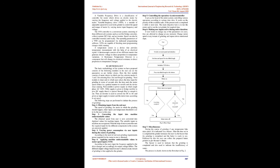Touch panels operate in several ways, including capacitive sensing and resistive touch screens. The most common technology used in the earlier days senses the change of capacitance where a finger touches the panel. Capacitance-based touch panels will not sense the tip of a pencil or other similar ungrounded or non-conducting element. On the other hand, fingers insulated by a glove may also be problematic. While touch panels like touch screens are able to sense absolute position, resolution is limited by their size. For common use as a pointer device, the dragging motion of a finger is translated into a finer, relative motion of the cursor on the output to the display on the operating system. Sometimes even hardware buttons equivalent to a standard mouse's left and right buttons are positioned adjacent to the touch panel.